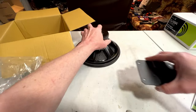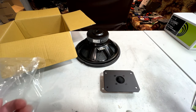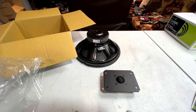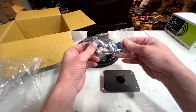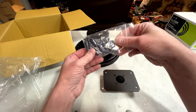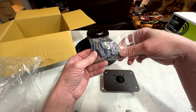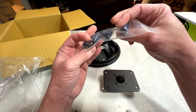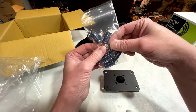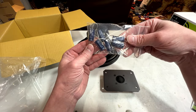But we've got our woofers, we've got our tweeters, and for crossovers, I've decided to go as simple and low quality as possible. Basically, all I'm doing is putting a capacitor in series with the tweeters. I can't think or talk again, apparently. So I chose 3 kHz, so this should do, and you'll notice that there are 6 of them.